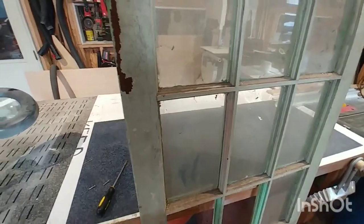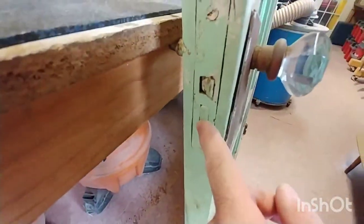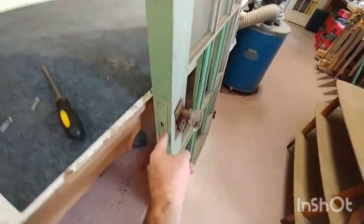Obviously, we're not going to stretch it. We're going to add some wood on both sides of it. But to begin with, we're going to take off this mortise style latch, and we're going to fill this. It's going to be a painted door application, so though we'll take the paint off of it, it's being painted in the end, so it won't matter that we've added an inch worth of lumber on both sides. It won't matter that we fill the mortise openings in it with Bondo or some such thing,